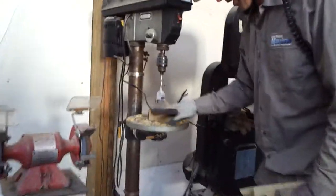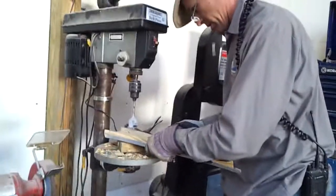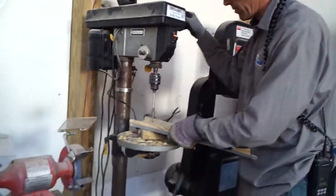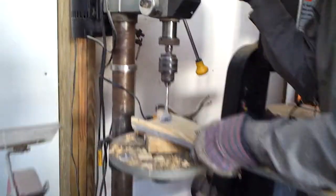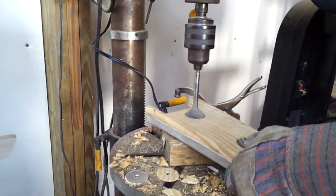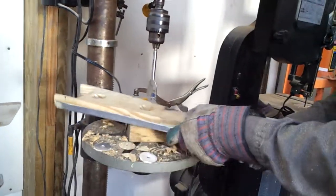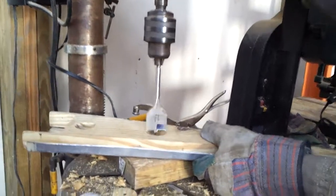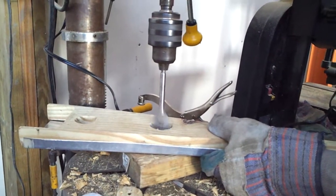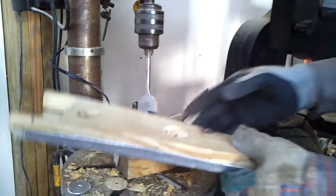This is nothing more than a high-quality wood spade bit — it will cut the aluminum. It may dull the bit if you're not careful, going through there, not pushing too hard. It's nothing to eat it up — job done. Same thing again. So if you don't have a plasma cutter, I'm sure that five-dollar bit is cheaper than the plasma arc. And pull that little boy apart.